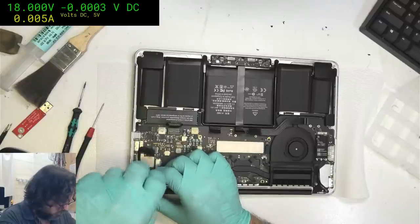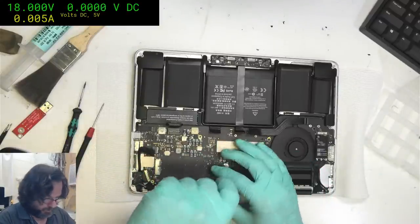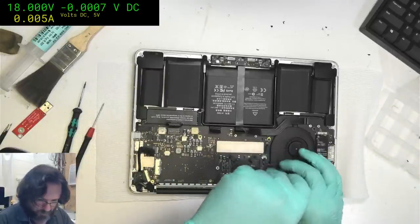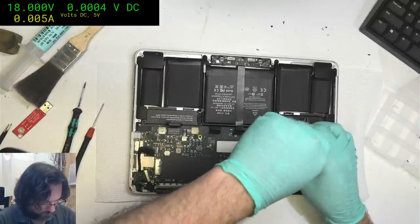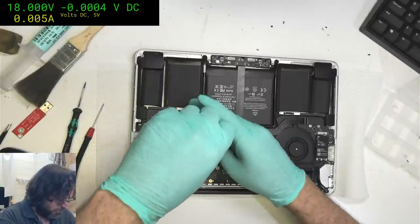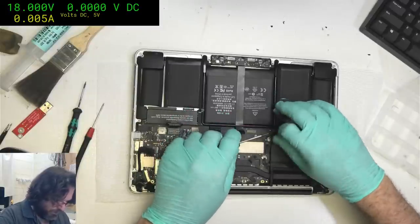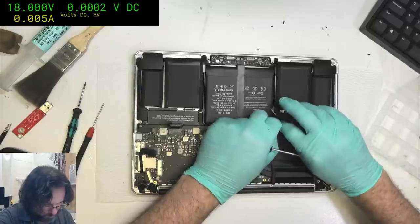We'll find out. We'll take the board out and have a look, because like I said, we've had a few other streams where machines turn up and they're all running fine, even though the person has said that they were not running when they sent it, and it turns out to be a nice little juicy chunk of corrosion sitting off something. The shipping process makes a corrosion crack.